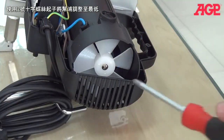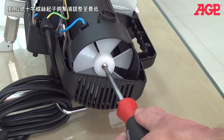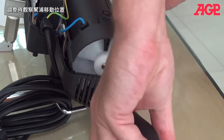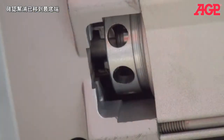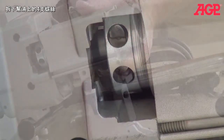Now we just have to turn the pump to its very lowest position. The way we can do that is just use a Phillips head screwdriver on the fan, then you spin the fan and watch the action of the pump and turn it. We're going to make it go to the bottom of its stroke. Okay, that's the bottom.